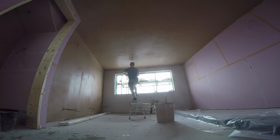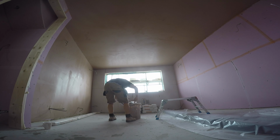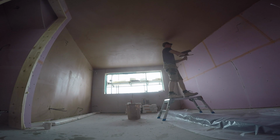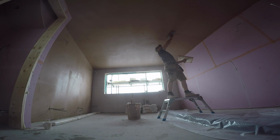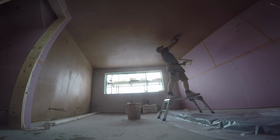So yeah, again, thin coat, making it smoother still this time. Keeping it nice, trying to make it even, and this time just fill in any sections that you've missed out. It's hard to see where I've plastered here, but basically, same direction, like I said. Meeting in the middle, same process. There we go. That's it, as you can see there.